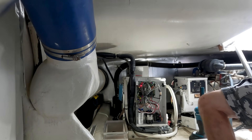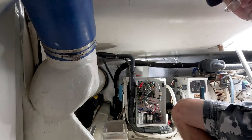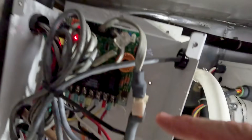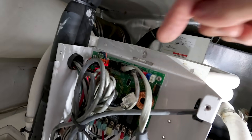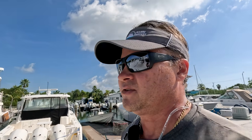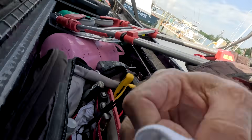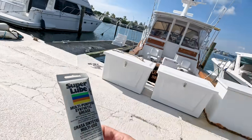Make sure this one's still running — yep, master safety room still running. I'm going to run to my truck and get some dielectric grease because these old four-pin connections are known for having corrosion issues, and I'm also going to put some dielectric grease on the connections up here. Here's my dielectric grease — Super Lube. This is good stuff right here.